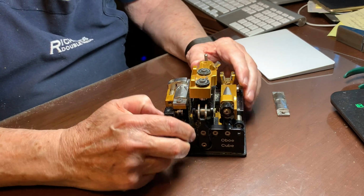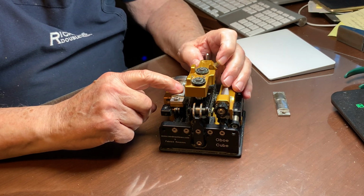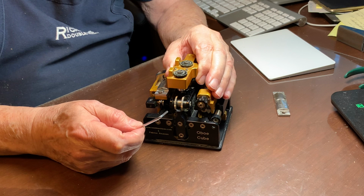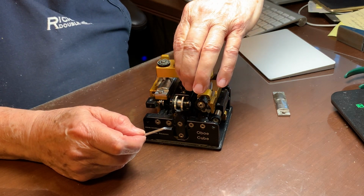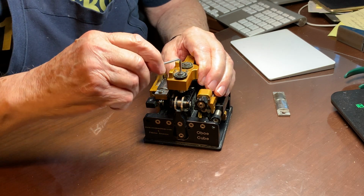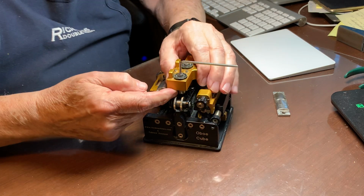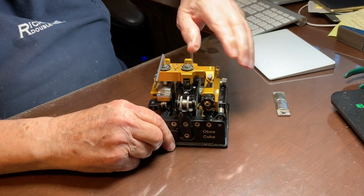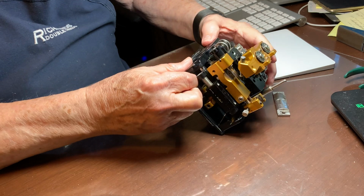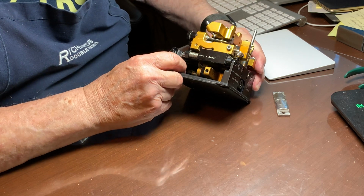Now, the most important thing I can tell you is this is the height of the machine. When you put a new template in or change the blade, the most important thing I can tell you is to take and make this as high as you can so the knife does not hit the mandrel. If you look at the top of this, there's a minus and an arrow and a plus. The plus, you turn it clockwise, it pushes this down. Therefore, when it hits here, you can see that it never hits the mandrel. It's always off the mandrel.